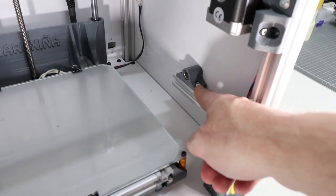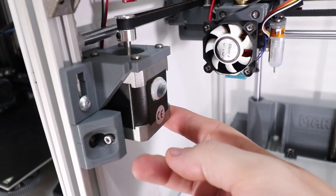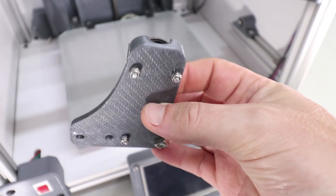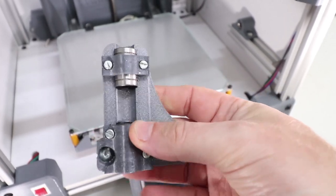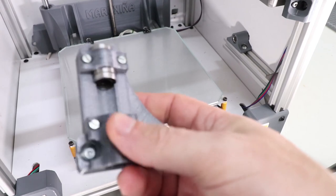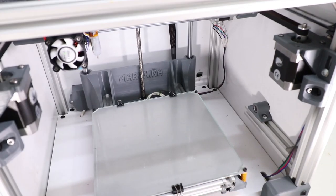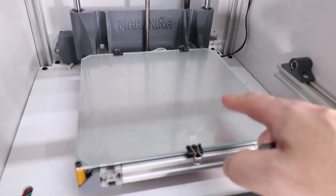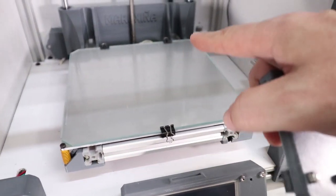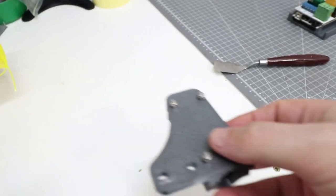I also designed a piece for the bobbin holder on the lateral side. Another nice addition is the motor supports that prevent the motors from flexing forward and backward — when the motor exerts force it no longer pulls back, and it holds much more solidly. The old Z-bed support was two individual weak pieces, one on each side, which were not robust enough to hold the bed reliably. The new support piece holds everything much more solidly — the bed barely moves at all now.